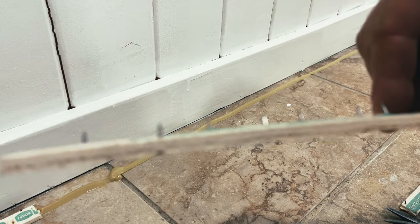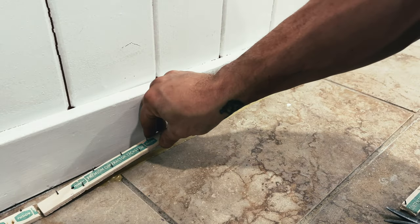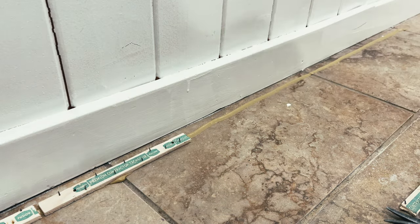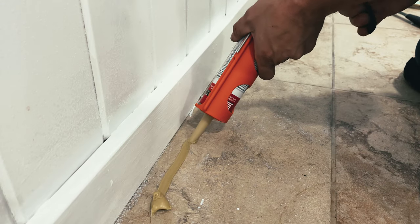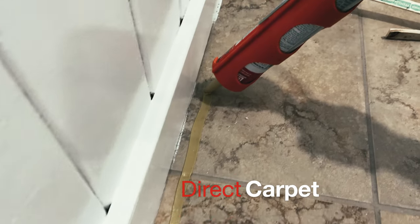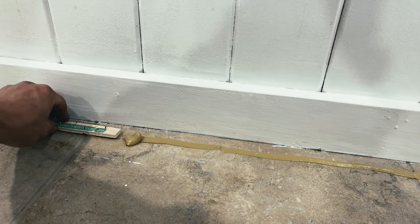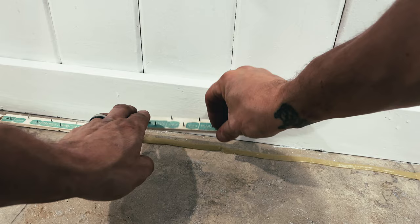This stuff is warped and it doesn't sit straight in the glue. This kind of holds it in place while it dries. Before I used glue, when people didn't want glue on their ceramics, I would just stain nail into the grout lines because that does not damage the tile. So if anybody's looking at not damaging ceramic tile, you can install full pieces of smooth edge into the grout lines with a concrete nail. You heard it here first. But with this install, we're going right around the whole perimeter with the metals, with the smooth edge, with the glue.